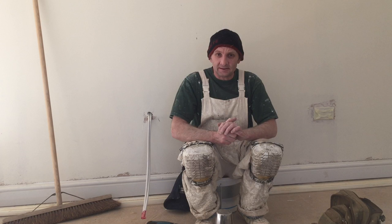Now, obviously, on the first day, you can only do so much. So, like I say, first thing I do, go around, fill everywhere up. Any woodwork that needs filling, fill walls up, etc. That's my first thing. But I do start by going around and filling all the door casings and arches first. Then I'll go around and do all the skirtings. The reason is, I want them door frames to dry off so I can get them rubbed down before I